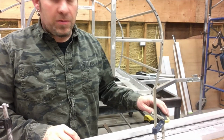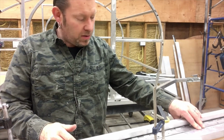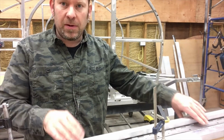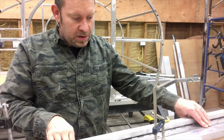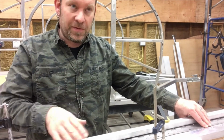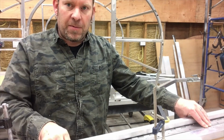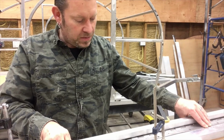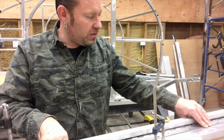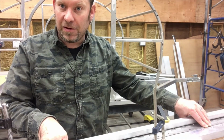All right, so I cut the hinge down because it has a 1/4 inch offset. One side of the hinge is longer than the other side because of the step in the roof, or the skin height for the galley, because it sits on top of the body versus flush with it. So it sits up higher, so I have to offset it. I drilled a bunch of pilot holes, just figuring it out. It's kind of boring and tedious, but the whole door literally hinges off of this.